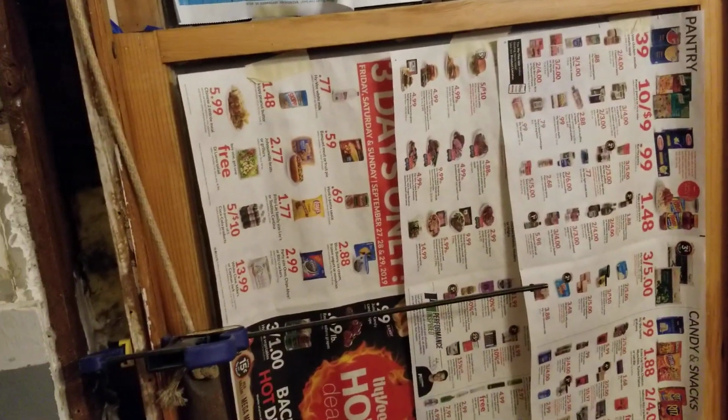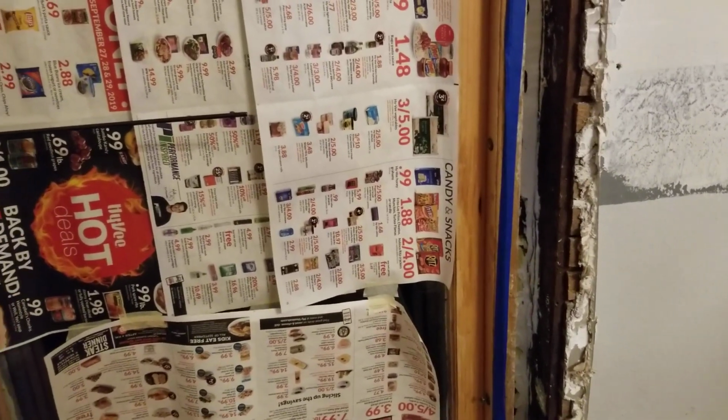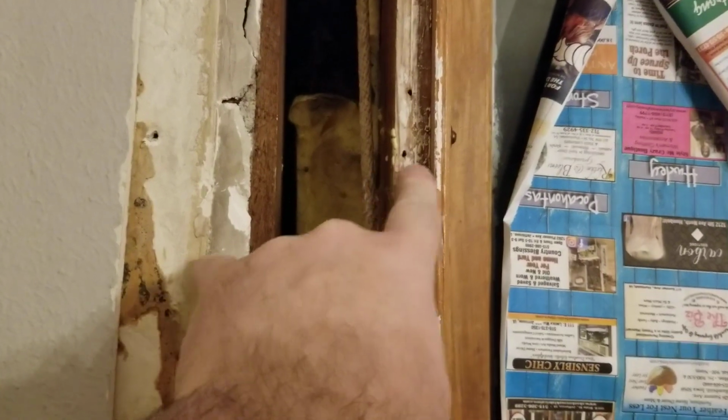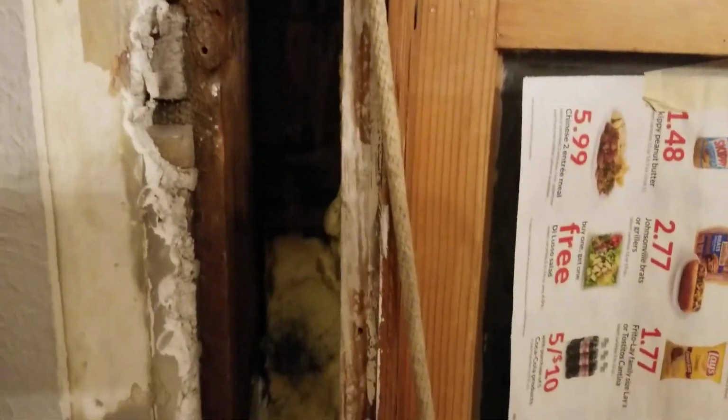But really, you can insulate these weight pockets and make them more efficient, and really do well with drafts, with the cold coming in and everything else. Some weight pockets have a cover on them, like mine do. They have these rough cut pine covers over them, so they cover the pocket itself. They sit between here and here, and then they just attach between here. But oftentimes people remove them, or they didn't get put in right, or who knows. We're talking 130 years. Who knows who did what?